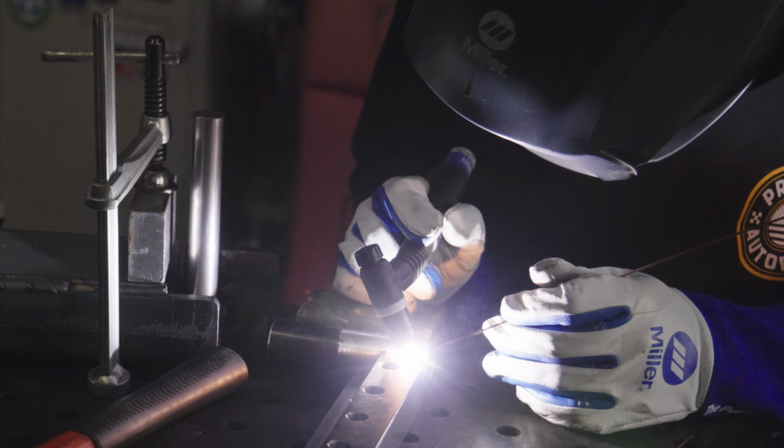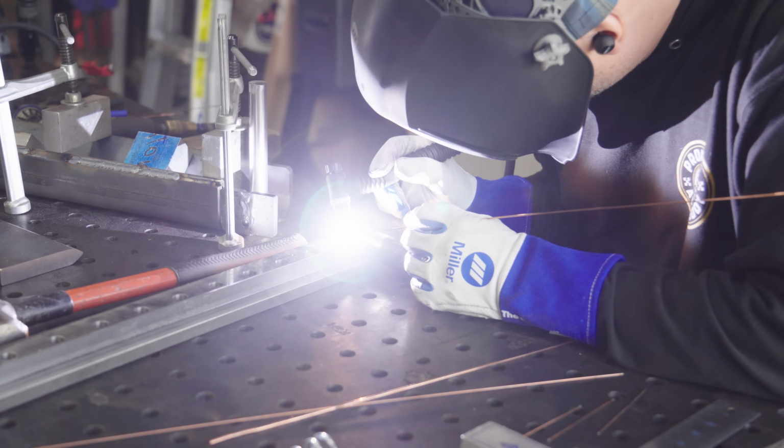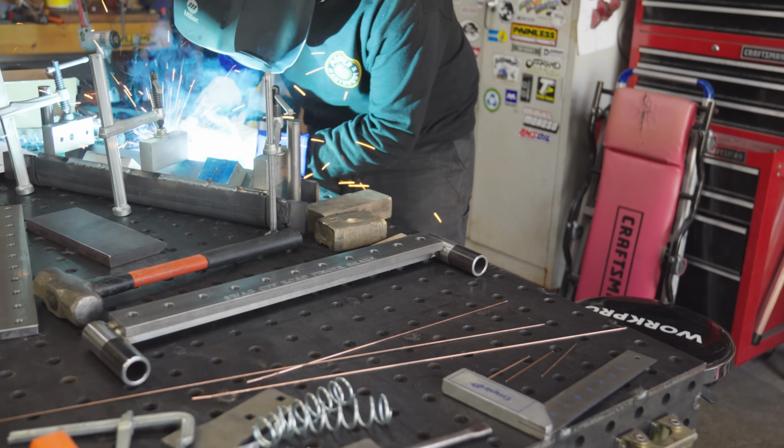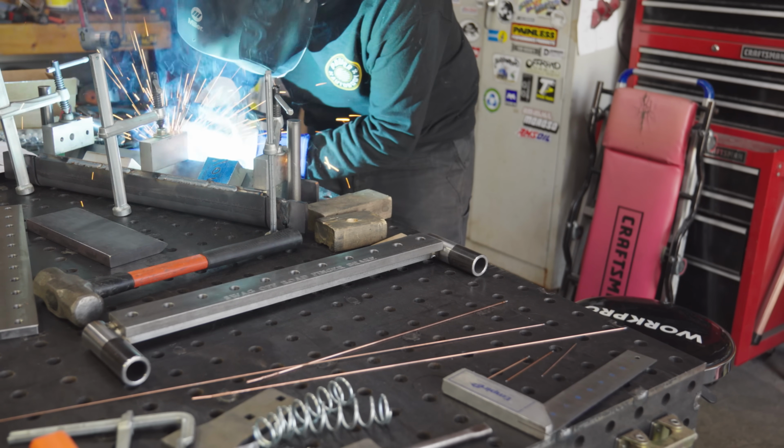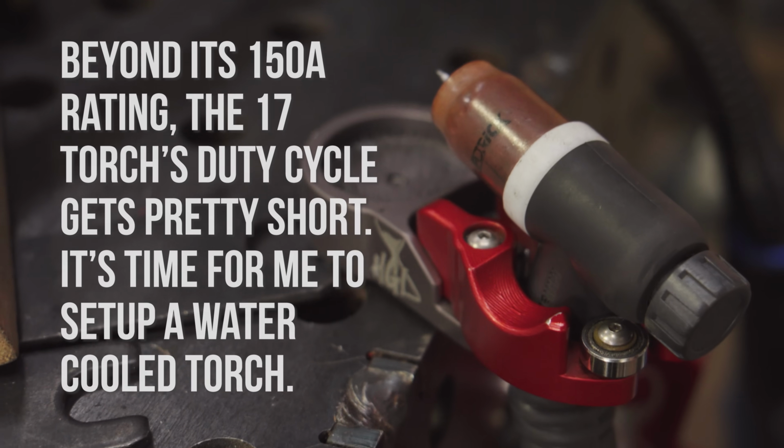Now, y'all know I am a big fan of TIG welding, and to me, whether you do a combo or whatever, that's totally up to you. But I'll tell you, even for my machine, which has an air-cooled torch, it'll take forever to TIG weld this whole thing because I'll just run up to the limits of the torch. You can do 200 amps, but only in short spurts.